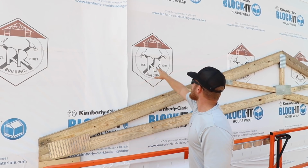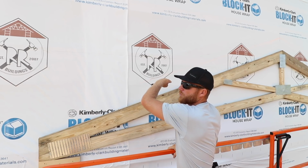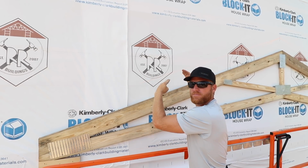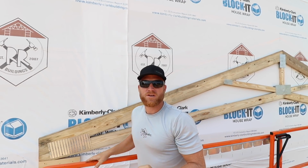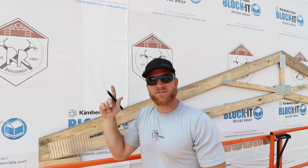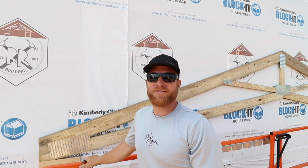And so right up here, all this is coming together, and we've got the roof that's flat, dying into a valley that goes to this pavilion that's a little bit taller. So I'm trying to get that intersection figured out so that I can make sure all of my trims are right, because once we install our upper steel over top of those trims, I don't want to have to take it back off if I messed up.